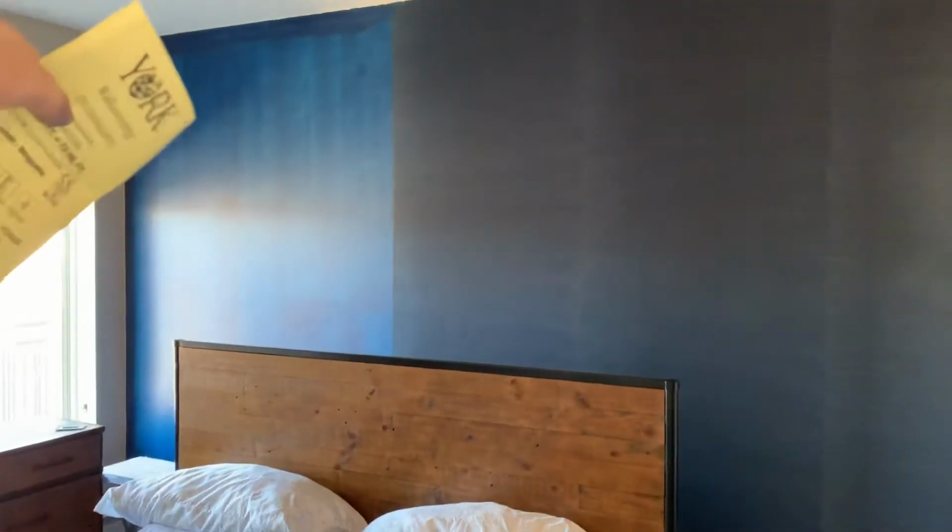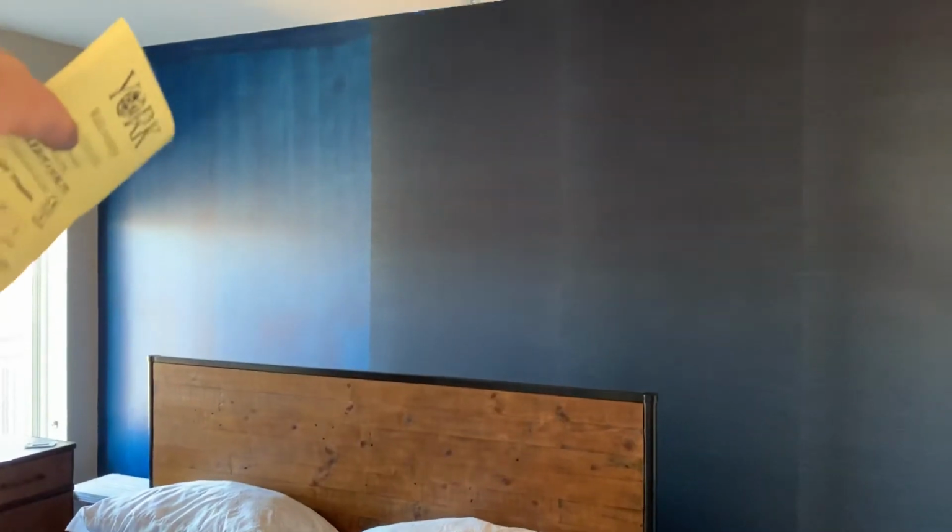And this is where, costing to do an accent wall, sometimes it's just as costly as doing a whole room, because certain things, like we're not just priming the wall, but we're putting a base color on there. So if you have a white wall, in this case gray, if the seams aren't completely straight, we're not cutting the paper. You can't cut the paper, it's like a grass cloth rayon, so you cut it at frays, so it's made to go up and be paneled. So just the imperfections in the wall, sometimes you can have the thin slice of a paper, that thin of a seam on there, but it's white, it shows right through.